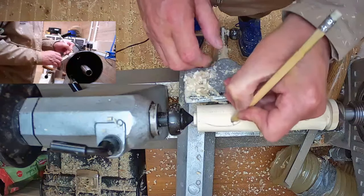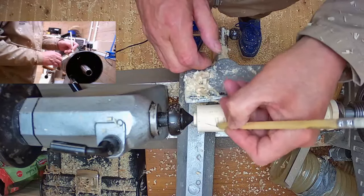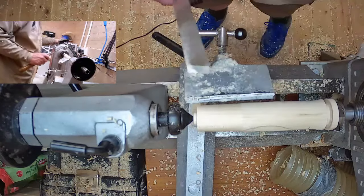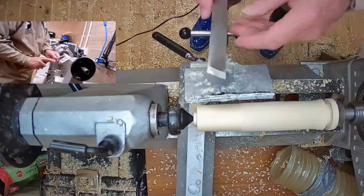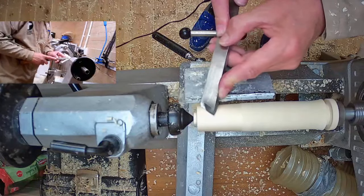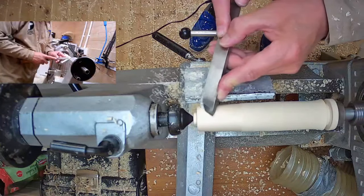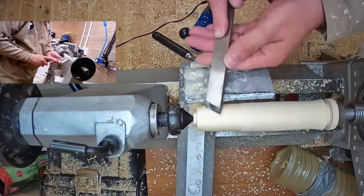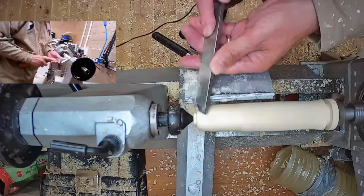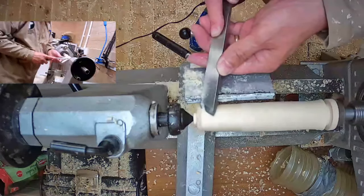We're going to be making something of this shape. Grab all the parting tool grooves, cut it now. Shaping this round — basically a honey dipper is rounded at the end. Just pick it up and roll, just like you turn a bead. Roll it over. Now flat, let's start to chase the handle so it goes more towards the base or the short point.